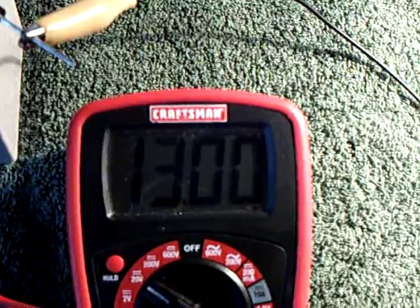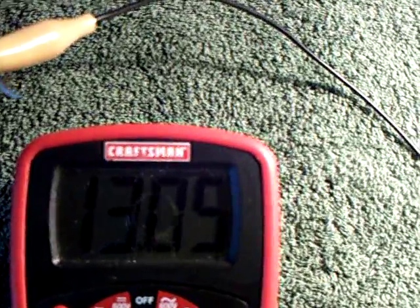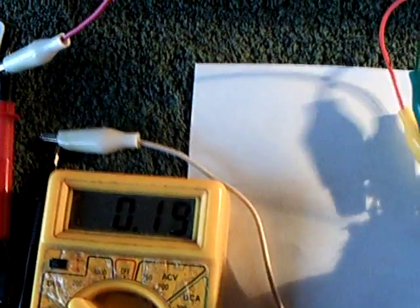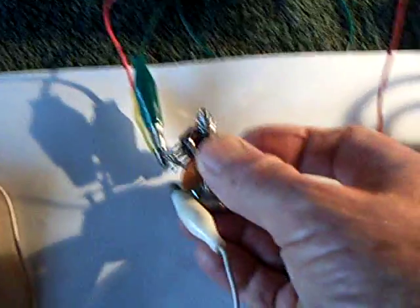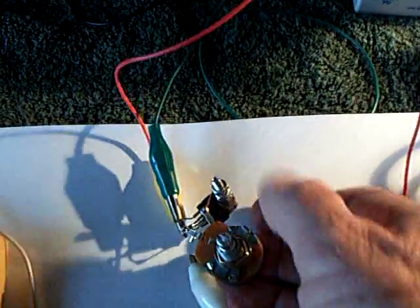This was successful — it was a way to get the energy off, and I tried it all over the circuit. This was the place I found where I could actually get it to go into a capacitor and it would stay. That is the circuit for today. If you guys want to make this, just make sure you keep your drive draw down. This rheostat — this 25 ohm rheostat — without a heat sink on it, it gets pretty hot.